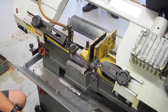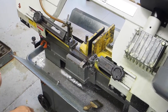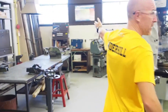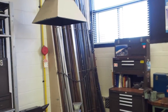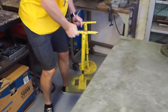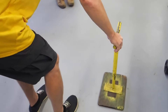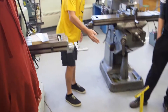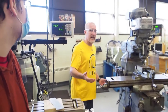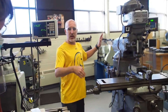Rule number six: guard long material at both ends to prevent anyone from coming into contact with it. We're going to have long material — if you can see over to the rack here behind Arthur, there's very long material in the rack over here. These pieces are the ones that are going to go into the saw. As we put those pieces in, we're going to use these supports here. The piece is going to come way back here like this. You need to stand here to guard the piece that comes out of the end, so that if somebody walks by, you say 'hey, whoa, there's a piece here' so they don't walk into it.